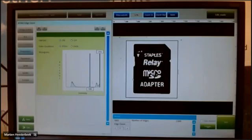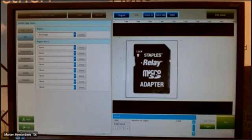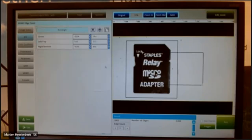If I only want to find the left and the right edge, I have to do something in the middle, because, of course, these letters have also edges, and that is not what I want. So I can go back to my region of interest. That means my region of interest is not the complete SD card in this case, but only the outside. So I can put a mask there, in this case a rectangular mask, over my letters, because I only want to see the edges and not the middle.